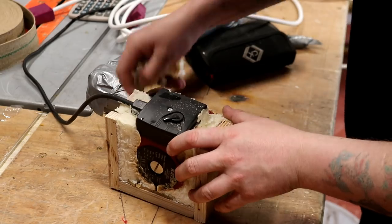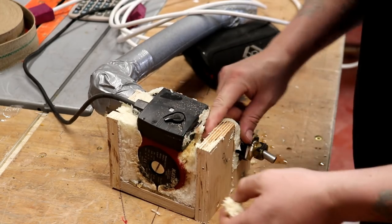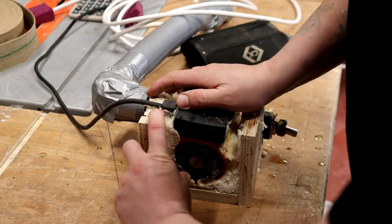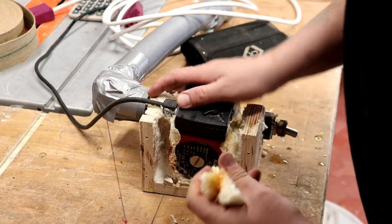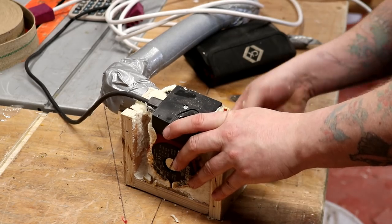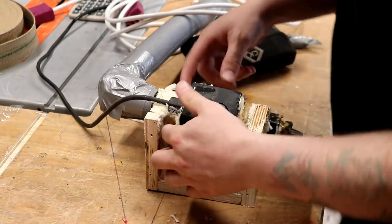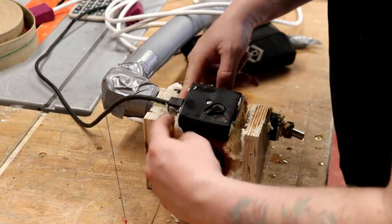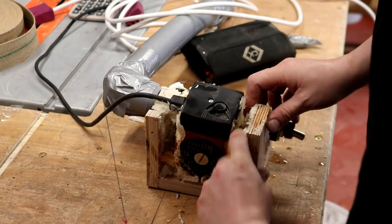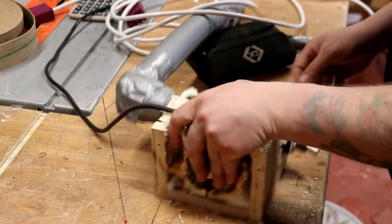I don't think the foam's been the issue, in case anybody's thinking about putting that in the comments, because this pump is cooled by the action of the glycol running through it. But what happens is, if the glycol is not being siphoned into the pump, then of course there's no cooling happening. So I think what's happened is there's been a break in the feed in the supply. And that break in the supply has caused the whole thing to overheat regardless of the foam, and hence the failure. This is what I'm thinking. I'm pretty confident that that's what we're gonna find out has done it.